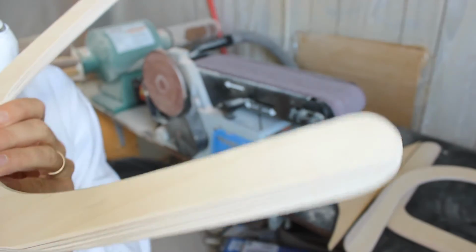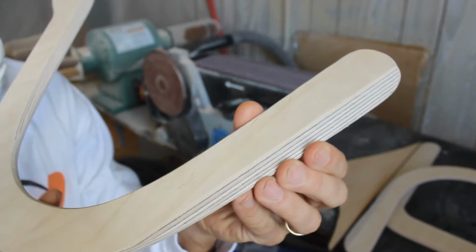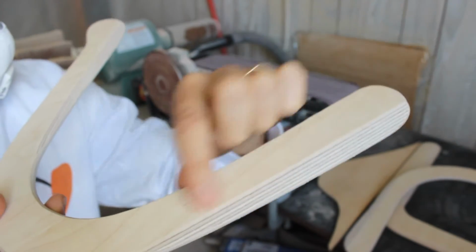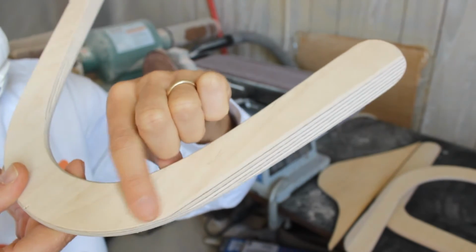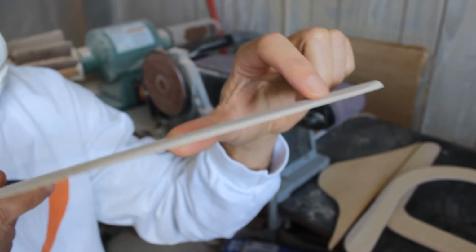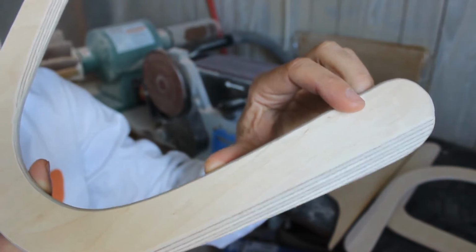Now the trail edge on the other arm, same way. Okay, quarter of the way across the arm and up in, and just let it kind of taper off once you get up here. And same idea, 2 to 3 layers of wood left over. Okay, so that's basically it there.